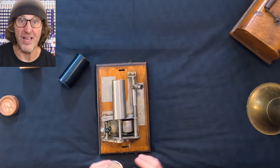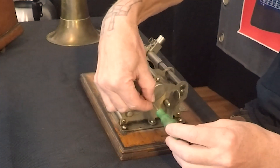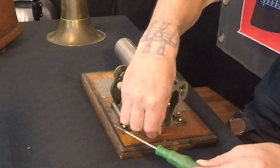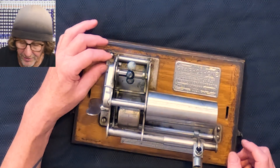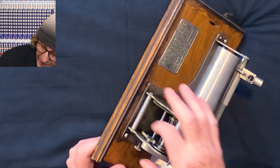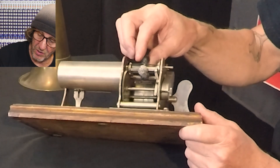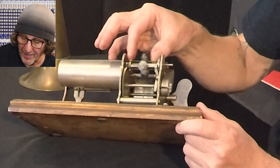We'll work on that as well - we'll want to seal that up. Let's get inside this belt chamber. It's got some muck and grunge all around it, but I kind of like it in its old and worn state. Now the speed control: this screw right here is the speed control. It pushes on a lever connected to a little pad on a metal hinged piece that rubs on this wheel. When this thing's going, the centripetal or centrifugal force throws these little bakelite balls - they expand, bending these springs, and pull in this brake thing towards the wall and that little pad. That's how it has a speed control.